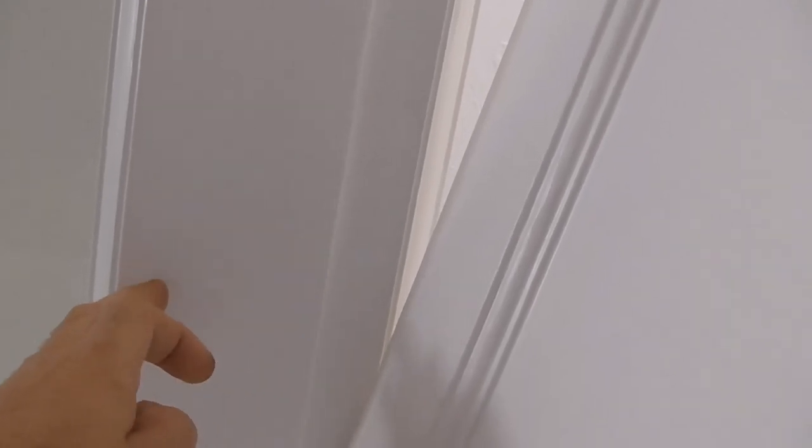I have a clock to go above this door on the wall. This is a hard wall, solid brick. Look at the door jamb here — the thickness from there to there is a brick-built wall running through plaster either side, which will be old powdery plaster, or the architrave sitting on this side. I can have problems drilling into old plaster brickwork: for one, you can't see the mortar lines, and two, you've got a powdery layer of plaster. It might be quite hard on the surface, but behind that the old plaster will have just decayed and degraded.